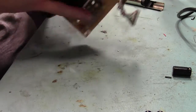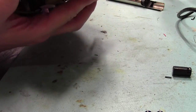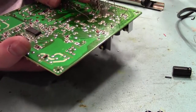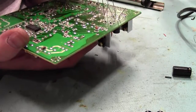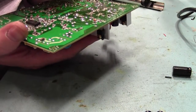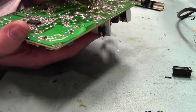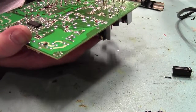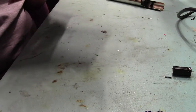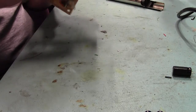Yeah, they're all in. Hold them in place, flip it upside down, bend the legs out. And we're done. And these are actually 2 1000s in parallel. You parallel them up, you reduce your ESR, and again you increase your capacitance. So your capacitance goes up, your equivalent resistance goes down. Good tip. Okay, so if you've got high values, you can parallel up, and it does improve.